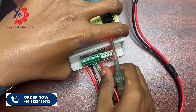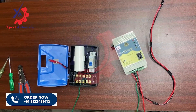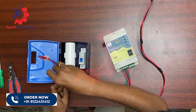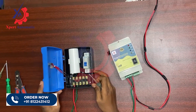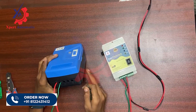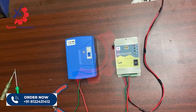Next, for phase I have taken a wire and from the output terminal phase of my control box I am taking a wire to the panel box phase input. That's it with that connection. Next we can connect the R, Y, B wires going to the motor and then leave the MCB in the turned-on position.